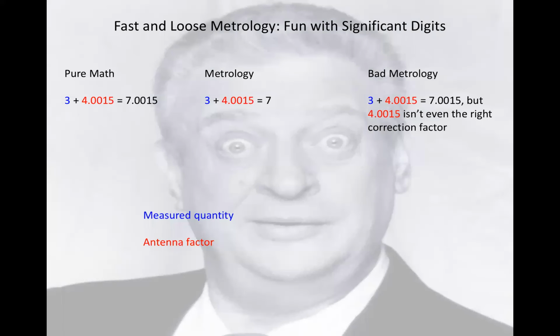This entire slide is on the one hand factual, but controversial, so we'll say it's my opinion. Consider the train of logic or illogic presented so far. We must quantify something which cannot be quantified in an absolute sense because the measurement result depends on the tool we use to measure it. The best we can do is agree to a standard measurement so that we all get the same answer. To the result from this standard method, we add minor corrections based not on the measurement itself, but on the tool's calibration, which purposely minimizes effects that are present to a much higher degree in the measurement setup. It's bad enough to ignore the concept of significant digits. It's adding insult to injury to require a correction factor that doesn't represent the measurement itself, but only a minor imperfection of the tool's calibration site.